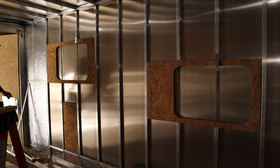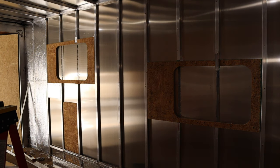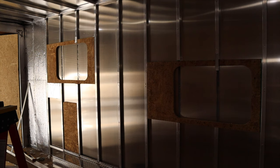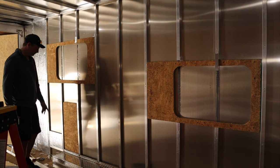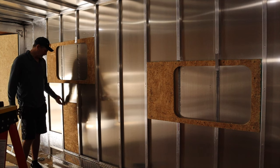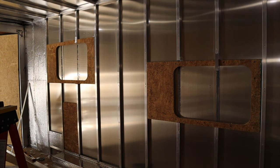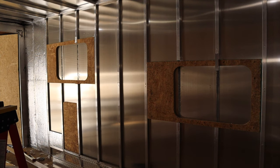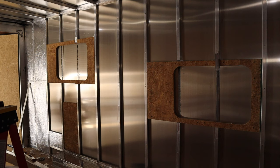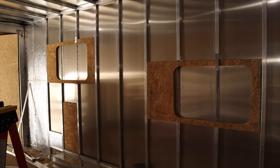I've done this with the previous trailer before - that's what we're going to do here. It'll work out, and obviously insulate around the window, not in it. I put this board here and I'm going to put a half inch over this because my 30-amp outlet is going to go in here, and I want to have something to screw it to. I'm trying to plan ahead. This stuff is really easy to work with - you just score it halfway through with a utility knife, it's kind of like drywall. Break it, score the back off, and cut your height.